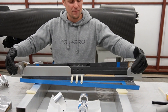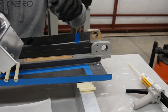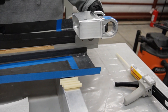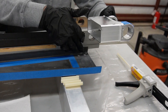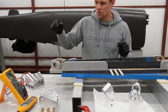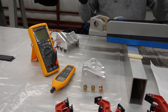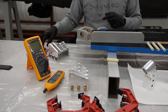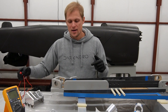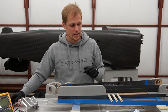We also apply a layer of fiberglass on the bond area to form an insulating barrier between the metallic component and the carbon fiber strut. So all these bond areas have fiberglass in them. One way we check that is with an ohmmeter — you can just check for conductivity to ensure that it's not conducting between the metal and the carbon. We'll check this along the way as we're bonding these together, just touching between the carbon and the metal to double check that.